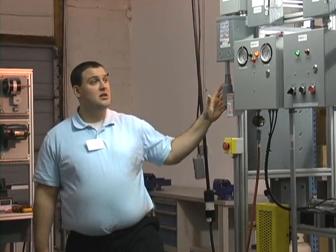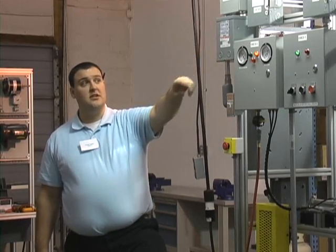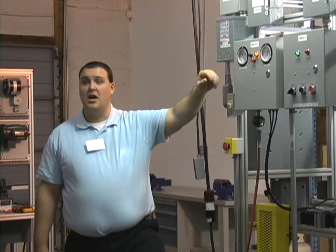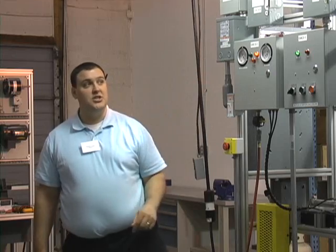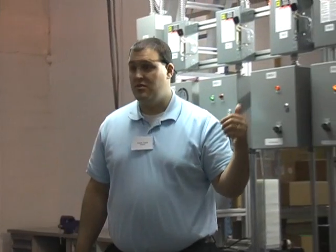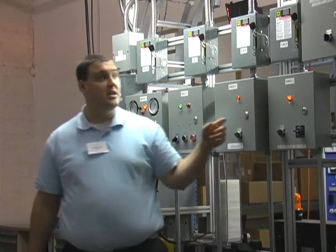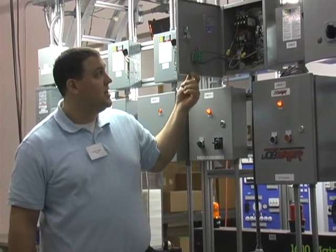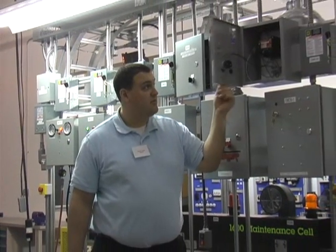The students will put in that infrastructure and install safety disconnects, which all have lock-out/tag-out capabilities, for each of the technology enclosures for the rest of the system. In addition, they'll be installing all the lighting — high bay, low bay, fluorescent, outdoor flood lighting, pendant lighting — through a series of different types of switches and higher-voltage industry lighting contactors that are familiar on the plant floor.